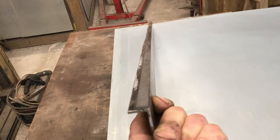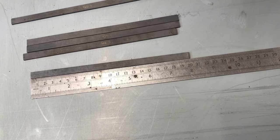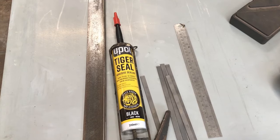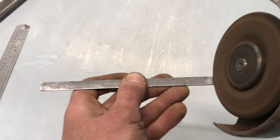This is a piece of old angle iron, but I have glued pieces of tungsten carbide strip to the angle. They are 200mm long by 2.2mm thick. The adhesive I used was Tiger Seal spread evenly across the face. Tungsten carbide is very hard and to grind it you need a diamond cutter — a normal steel cutting disc won't have much effect on it.